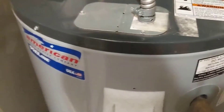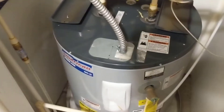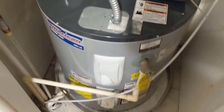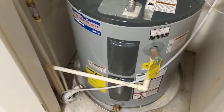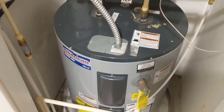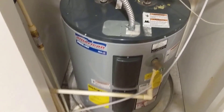I don't hear anything — let's go see if we hear the water heater kicking on. The tank is on, I can hear the elements, so everything's heating up. I'll put the covers back on the water heater and put the panel back on the breaker box. Water heater is heating up, new breaker is in and on, covers are back on both the electrical panel and the water heater — everything's working. Bad breaker was the culprit. Thanks for watching, see you on the next one.